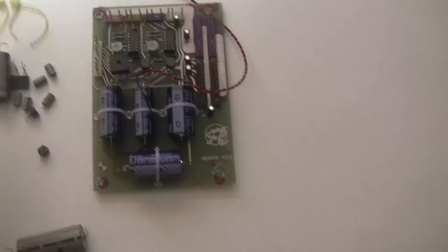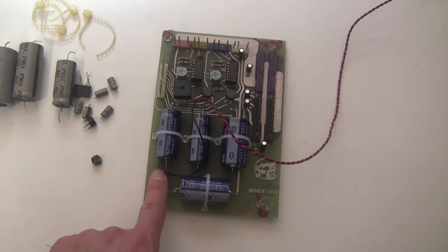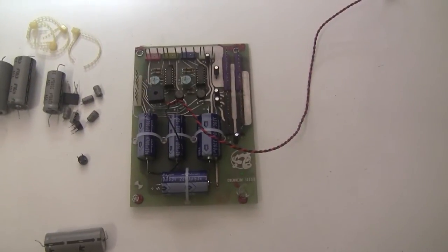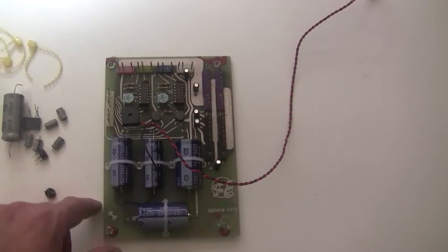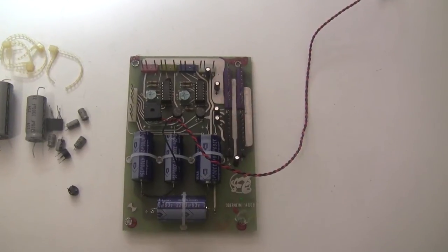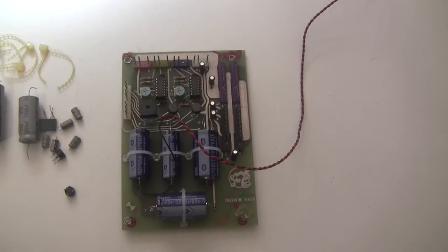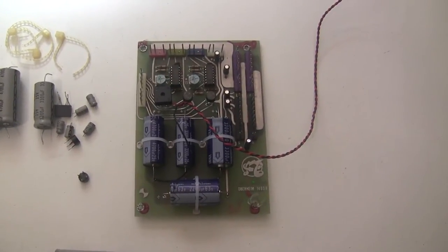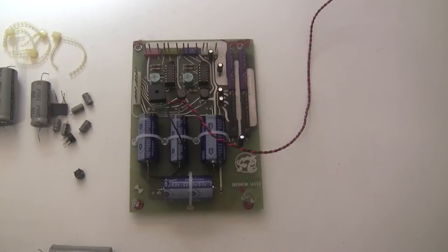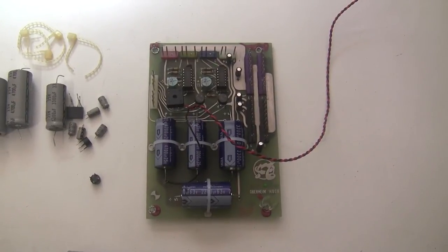One other thing: I reinstalled the wire to the Kenton MIDI kit. Because of that wire, it's not going to be straightforward to pull the bender board circuit out later to repair the switch, so I don't want to hard-solder the wire back to the power supply at this point. I'm going to reinstall the power supply and leave the voltage calibration until after we finish the other repairs. Now I'm going to turn my attention to the DIP switches which disable the voices — the DIP switch needs to be replaced with a new one.